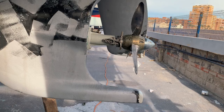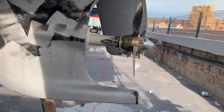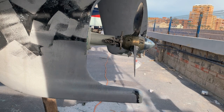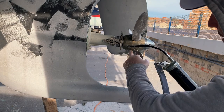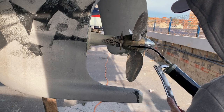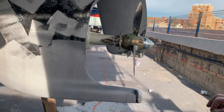Greasing your prop is fairly easy — check the instructions for your specific propeller. In our case, there's a little grub screw you remove with an Allen key. You then attach a grease nipple to the hole and attach a grease gun to the nipple. The grease is supplied by the propeller manufacturer, so contact them to ensure the correct viscosity. This fills the feathering blade mechanism with grease, and as a secondary benefit, it flushes out any residual salt water or debris that has accumulated inside the prop boss during the season. Finally, remove the grease nipple, apply a little thread lock to the grub screw, and reattach it.